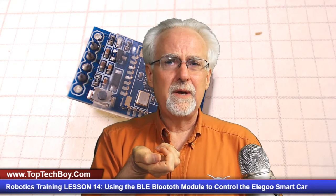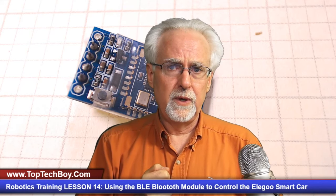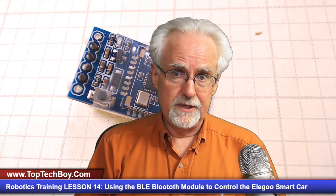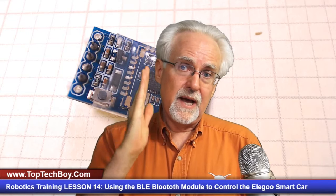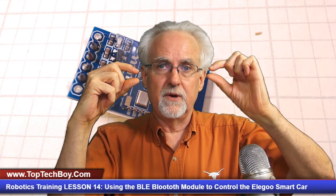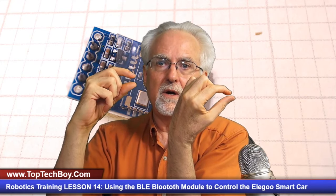And what does that mean? Imagine a really weak flashlight; you're sending a signal over a really weak flashlight. With the smart car, you can probably get about 8 or 10 feet, and then it starts operating pretty unreliably. You're not getting clean signals. But if you go like 6 feet and then turn the car around, it loses the signal, because the signal with photons is line of sight. The little emitter and the little detector have to be pointing towards each other. When you get out there and turn the car around, now the car is blocking the photons and you lose connection. So we need a better way to communicate with the car.